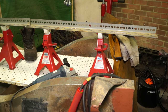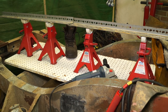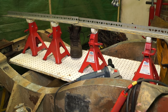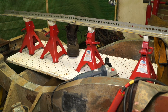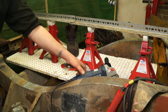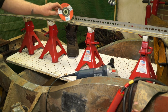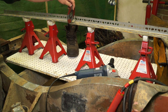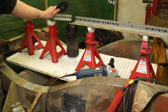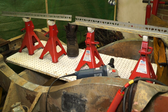Okay, back to our channel, Land Rover Toolbox videos, and here we have an engineering principle. You've got supports, and with a break in the middle, it's not going anywhere, is it? Now, you wonder why I've got a boot and a cutting disc. Well, what I'm trying to explain to you is about cutting: you need to support your metals when you're cutting for two reasons. One, if the metal falls, it could hurt you, and two, you don't want to nip your disc. The boot is going to be a demonstration.